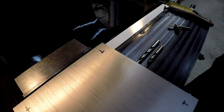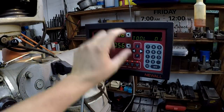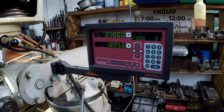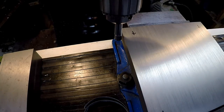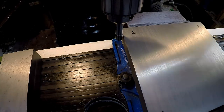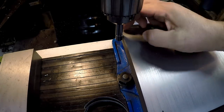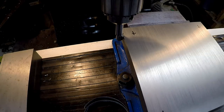We're going to pick it up, and then come up here to the DRO. We're going off the Y axis, which is the top one right here, so we need to zero it out. Hit that to zero. Now we're going to go to the other side. Let's make sure it's kicked off. It doesn't really matter how much you're touching of this thing because it's a ground true cylindrical surface. I usually just go around 1/2 of it or so, but it doesn't really matter.